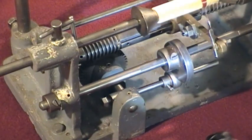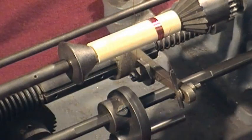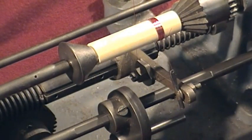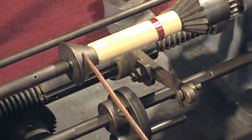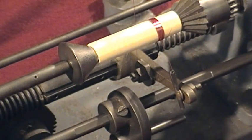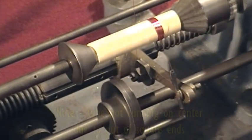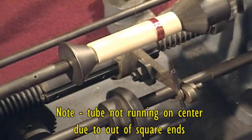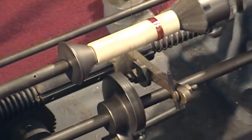There are so many adjustments it's actually quite perplexing at times. And more or less finally, just a closer look at the feed area onto the bobbin — or we'll call this a bobbin, although it's not. We've got the free-turning centre which is locked on this bar, the cam, cam follower and then the feed arm. So let's put a little bit more wire on there — it's not set up for the diameter of the tube but you can see how things operate.